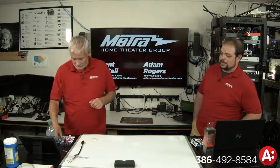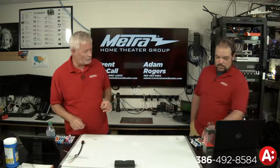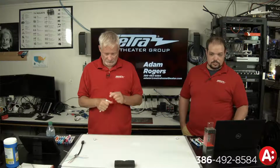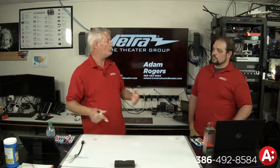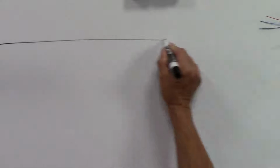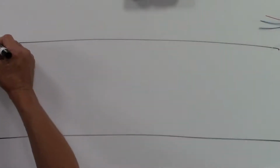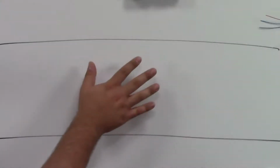Now, when you're looking at this, I'm going to create an eye pattern, because this is how we test these things. An eye pattern is just how the scope looks at the signal, and it's an on and an off. For custom integrators, it's ramp time, it's rise time. It's the basics. So we have an effective 5 volts and a 0, a 1 and a 0, an on and an off, a yin and a yang, whatever you want to call it. So how we generate an eye pattern at high speeds is we're going to send a variety of different data.